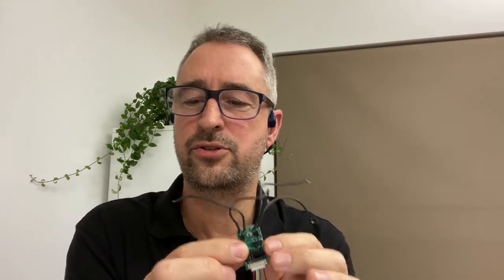The last two outputs on this are binary switch inputs. You run a positive to the switch, and the other side connects to either the brown or the orange wire. That will come up as a sensor inside your Shelly app or Home Assistant, giving you an on or off reading. On the other side of the board we've got two potential-free outputs. You connect the power to your device, then connect the device to one side of the switch and the other side goes to the negative of the supply. Always remember it is limited to 100 milliamps - if you go over that, you'll burn the device out. So you've got two inputs, two outputs, your sensing, and your analog input - the Shelly Uni is very useful and I'm going to be doing lots of projects with it.